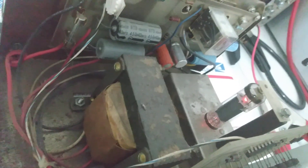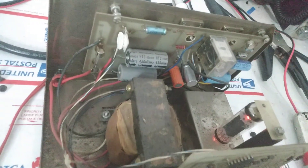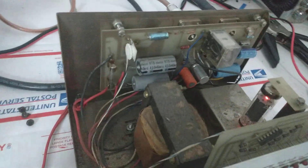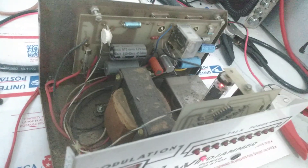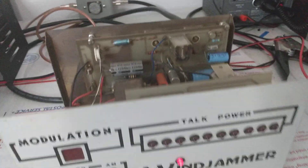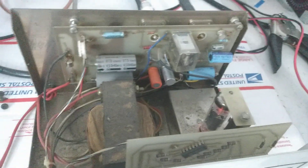Okay, we're back guys, and there it is — that 6BQ5. So we're actually pushing it pretty good considering it's just got one tube in it. If you push it that hard you'll probably end up replacing a tube every year or two, so I would probably step it down. I'd step it down to like a 15-watt or 18-watt radio, something like that. We're only putting 25 into it, but that is a very small tube and we're asking kind of a lot of it. There's an inside look at the amp. I'll take some pictures and get it listed on the website. Do as I say, not as I do — you don't want to be monkeying around in here with these things powered on. They do have enough in there to hurt you.